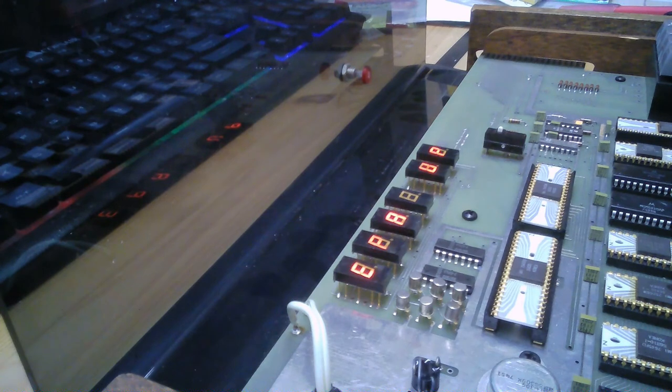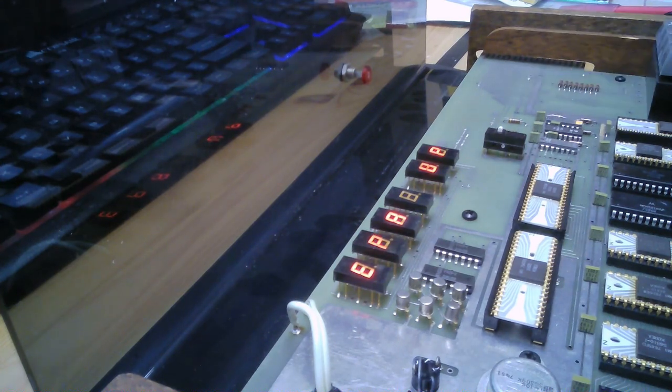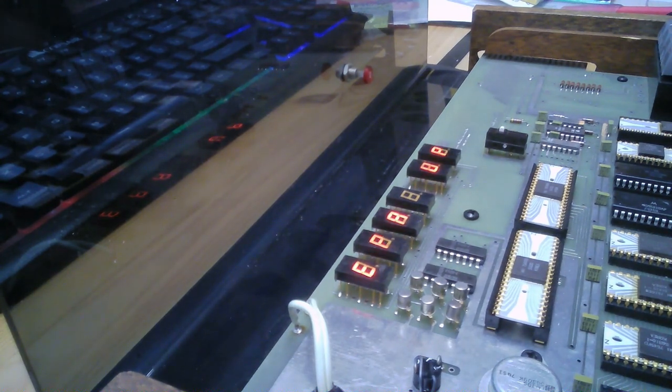Okay, I can tell you right now that pin 40 on the 6800 is not VCC, because I'm only getting 3 volts off of that. It's obviously a signal line. So let's see, try this guy right here. Yeah, 4.85, interesting. Okay, all right, well, I'm going to carry on, start from the beginning and try to re-enter that code. I was going along pretty good, and then that happened.